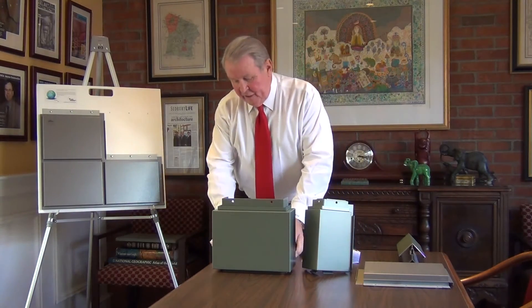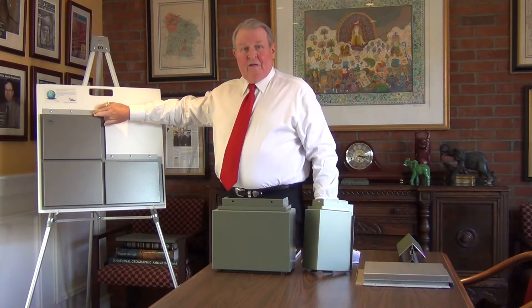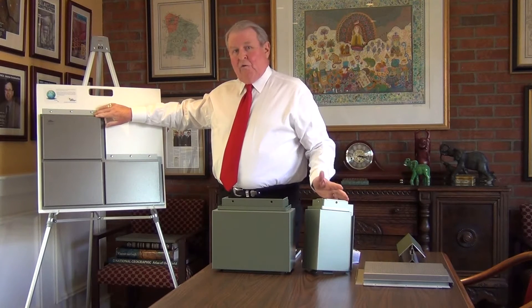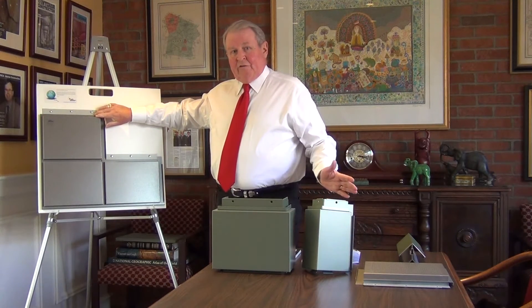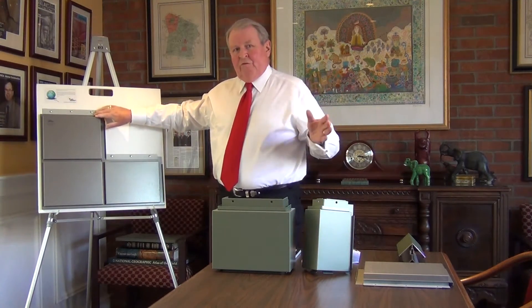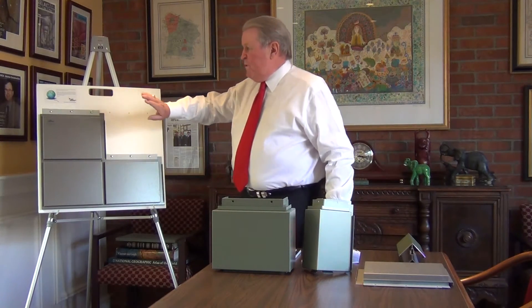In addition to that, there are the screws — nine inches on center — attached to your Z-channel or whatever other type of substrate system you're attaching to. That's it. Those are the three parts of the system. And then of course you have trim around windows and doors, but basically that's it. The system works beautifully as a pressure equalized rain screen system.